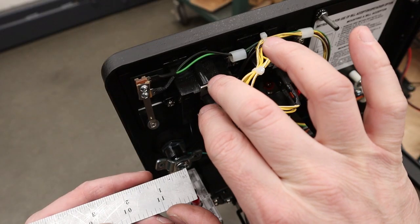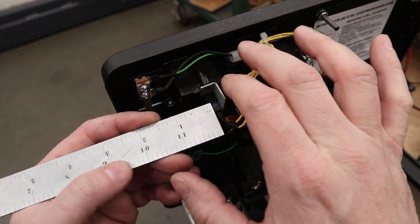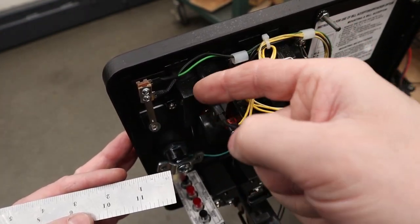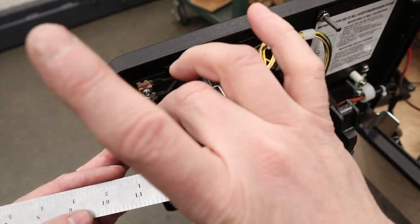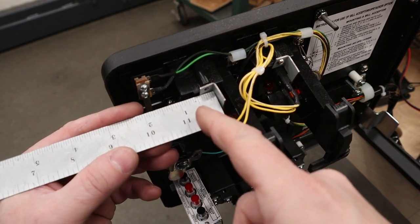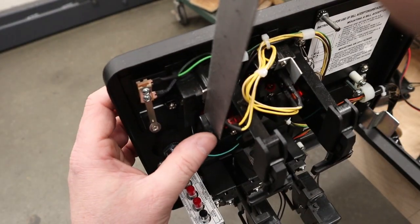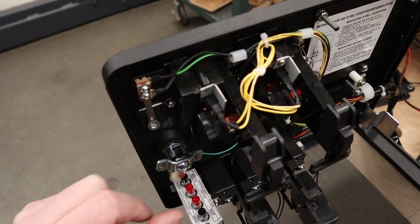Okay, because this lamp and bracket are right above where we kind of need it to be, there's not a lot of room here. So it's about 3/8 of a flat we need so that we have somewhere to screw that back in. And then it needs to get kicked out at a 90 degree so that this can get put to the side. So I'm gonna go, I think about 1¾ inches and then about 1¾ inches up as well. Let's try to go a little bit past here to hopefully make it a little stronger up here.